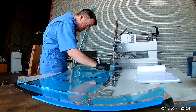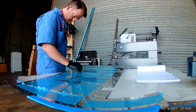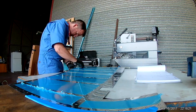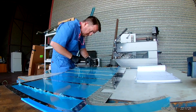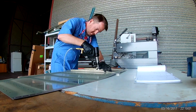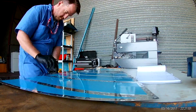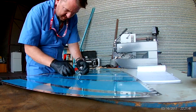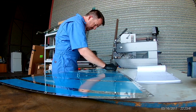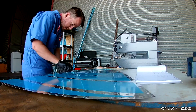It does provide a nice support so that you can lay in a couple rows of rivets. I basically put all the rivets in their holes — I don't use rivet tape. Rivet tape's nice, but I just prefer plain old masking tape, or painter's tape — but the low adhesion painter's tape, not the medium adhesion. There are different levels of adhesive quality for that blue painter's tape. Light is the best. If you get medium, it'll wind up sticking to all the rivet heads and you'll have to scrape it off with your fingernail. It takes forever. It's a pain.